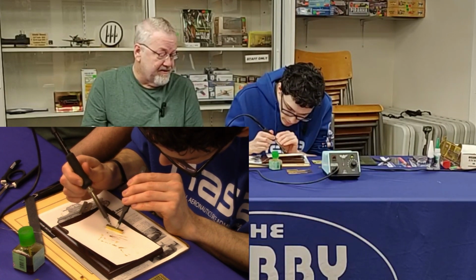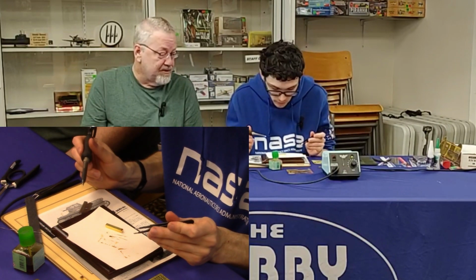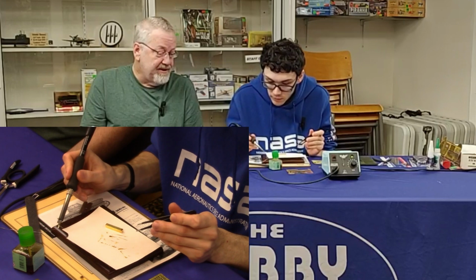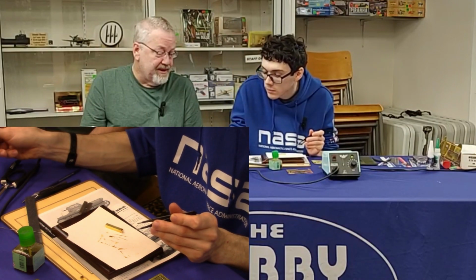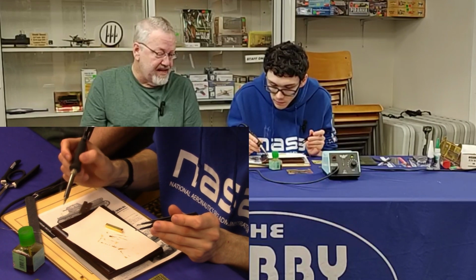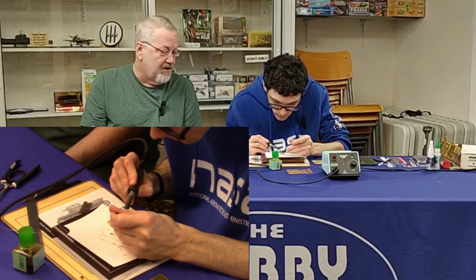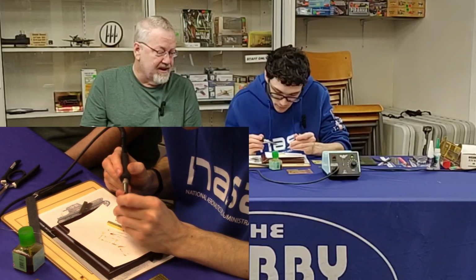You saw that I had to increase the heat to make it flow much more easily. If you use one of those $8 plug-in irons that just has one heat, you have no way of manipulating the solder. It's all or nothing with those, so I wouldn't recommend those.